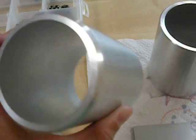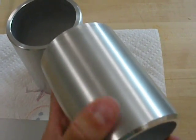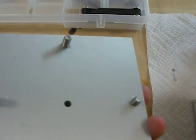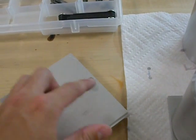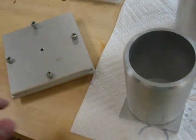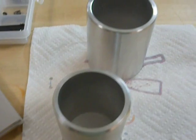That's it for day one. Stay tuned for more. I'm going to polish this so it's nice and shiny, and I'll be welding this in the next few days. This we cleaned up, mounted on the lathe, and spun down to a circle of about five inches in diameter. If you have any questions, post a comment and I'll try to answer them to the best of my ability.